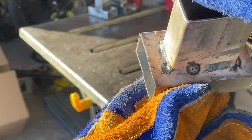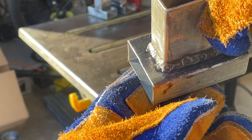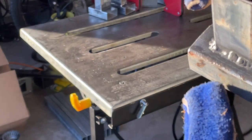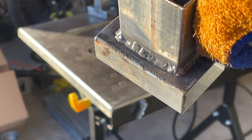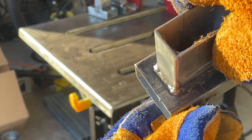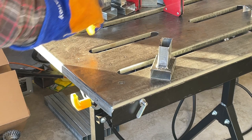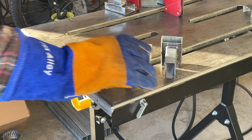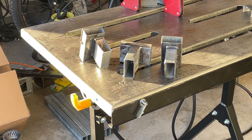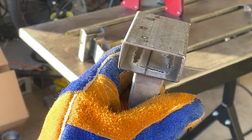You can see right on the corner and to the left of that T-joint where I burnt through, and after cleaning it up this is the result. There's a little extra weld bead where I covered up the burn-through spot, but I think that's totally acceptable for what I'm using this for. Almost no spatter — it all cleans off with the wire wheel from Benchmark Abrasives. In my opinion it really makes for a decent-looking, solid, strong weld, and those are the techniques and tricks I've learned for welding thin galvanized steel with flux core wire. Watch for my upcoming video where I actually build a DIY welding table out of this thin galvanized tubing. Click the video on the screen now for another one of my welding and fabrication videos.